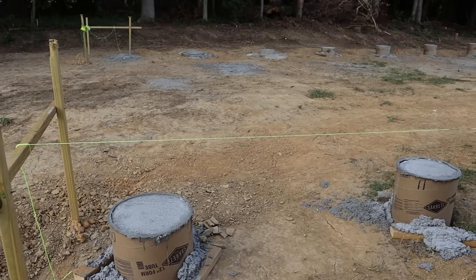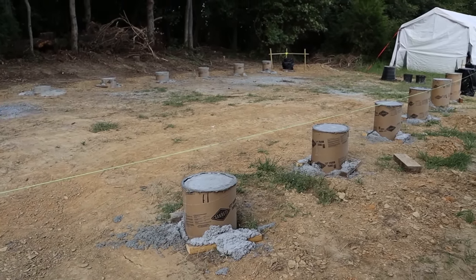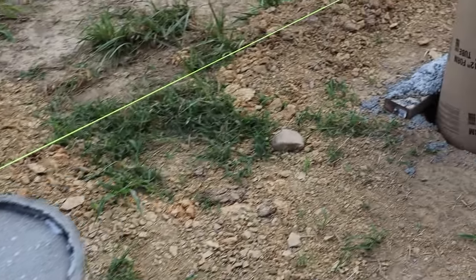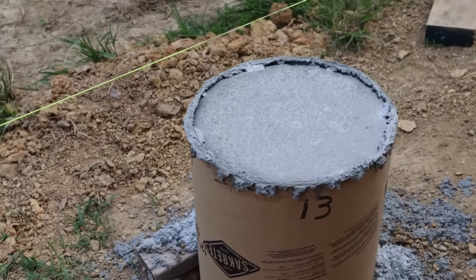I will say this, as you look at the footage here, you will see that as the concrete has cured, it has sunken and shrunk below the tops of those tubes. Yes, those cardboard form tubes that we spent so much time laser leveling, the concrete's not flush with them, or not level. So I need to decide if that's going to be an issue or not.